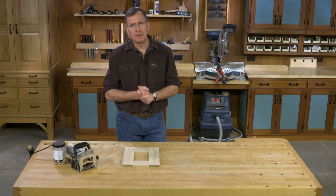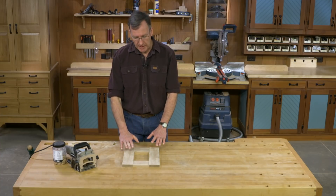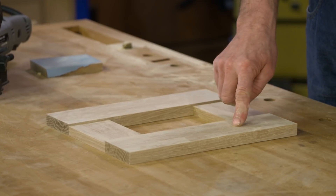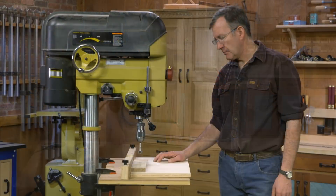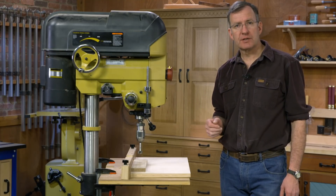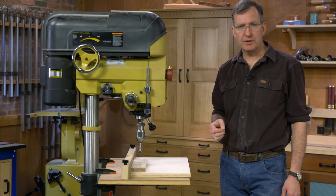That's what makes a very simple frame a craftsman frame. I have all my parts planed, thickness cut to width, cut to length. My next step is to deal with these pierced details, so I'm now off to the drill press to get started. The holes that begin and end each piercing are laid out with the interior dimensions of the frame, and the holes are drilled with a one-inch Forstner bit.